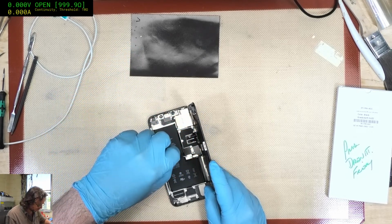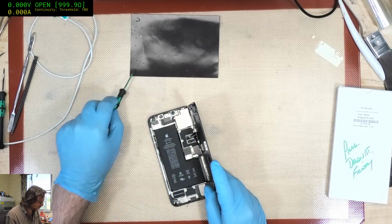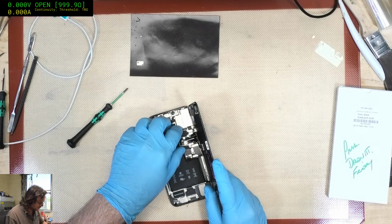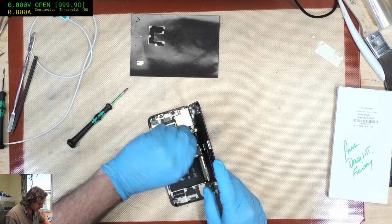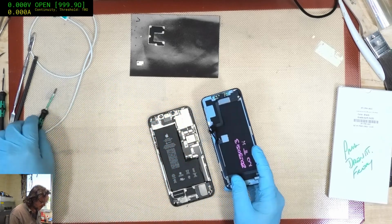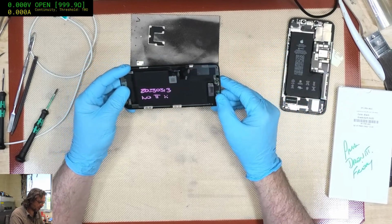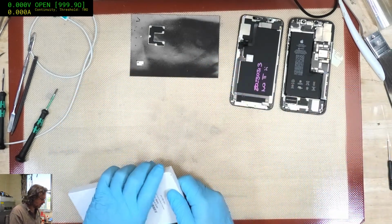Now the only downside with the new board is that it's still using the ATtiny2313, which is a very old controller, but it's one that I've got the software for and it works, so I'll continue to do that until I can find maybe someone's got an equivalent functionality with a Tiny45, or I would prefer maybe a Tiny412, something more recent. Because the Tiny25, 45, 85 chips, they're getting old now too. So the 2313 is even older still, but at least I can still source them.